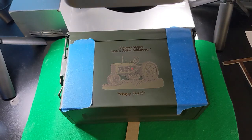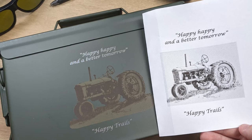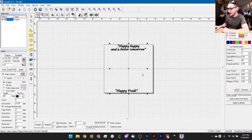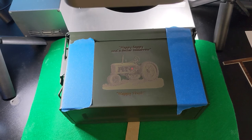Where do we go from here — do we anneal it or call it a day? I think we better anneal it. I don't want to oil this and get oil all over the paint because then it won't match the rest of the paint. Let's hit it with a quick anneal and wrap it up. I'll Ctrl+Z back to where we had both bits of text in. These aren't centered with each other but this is their artwork — I literally scanned it off a piece of paper. We're going to select parameters from artwork, steel anneal general. Let's run this and be done before we mess it up — anneal, and we're done.